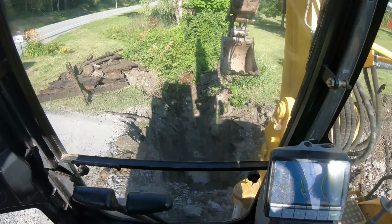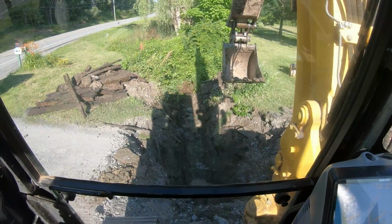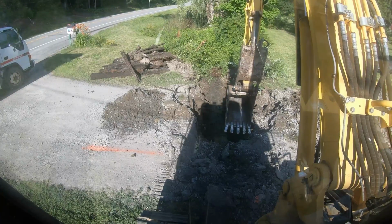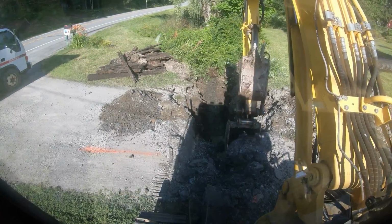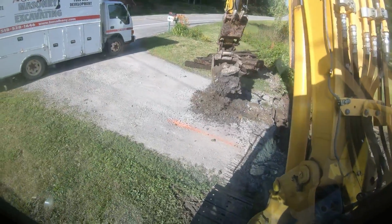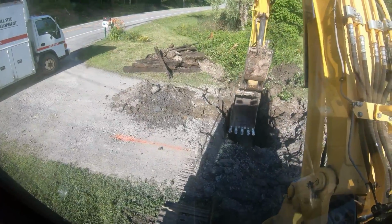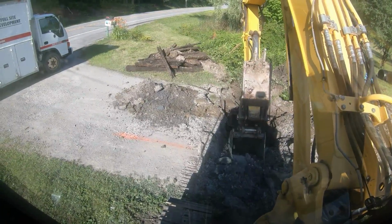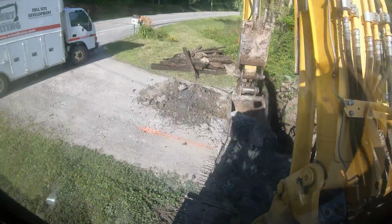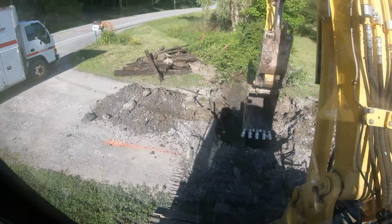But we're almost to a 20-foot stick there. All right, I got my mark to the left, that orange mark, that's my 20-foot mark. It's a little more than 20 foot to get the other stick in so I have enough excavated. Then my gravel can come and get over the top. I'll place this stuff back down in around it, pin it.